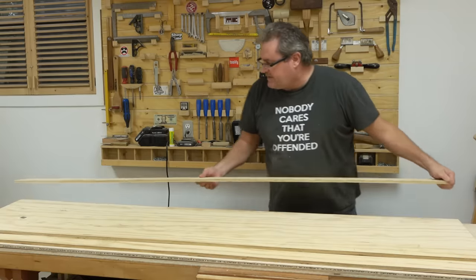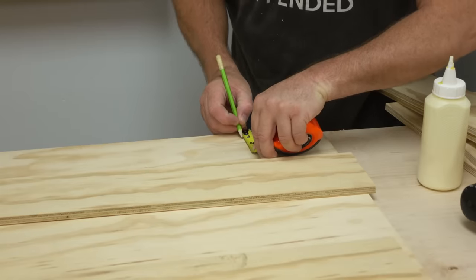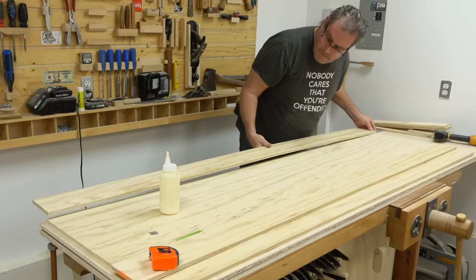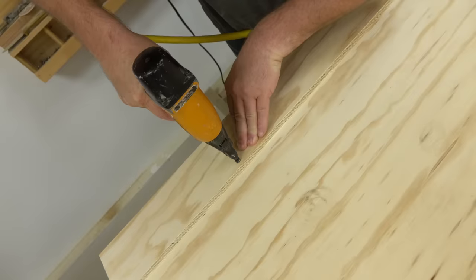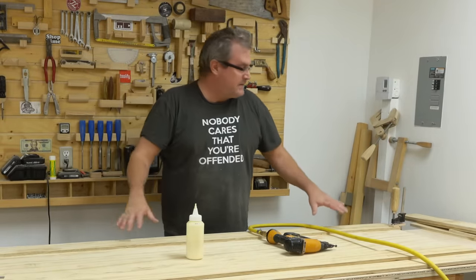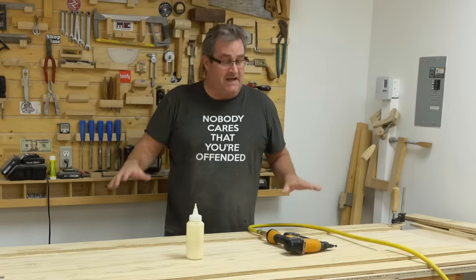The first thing I've got to do is attach this piece one inch in from the edge. I'm going to mark that with pencil on both ends, then run a bead of glue on there and fire in a few three-quarter inch brads to hold it in place. Then I'm clamping it down to the plywood underneath to pull it down nice and flat, so the glue dries with the material in a flat position.